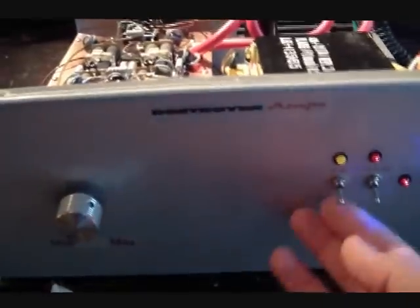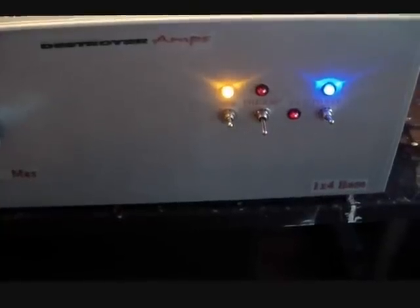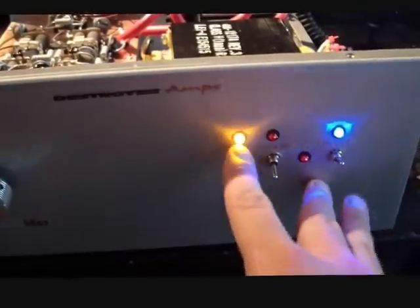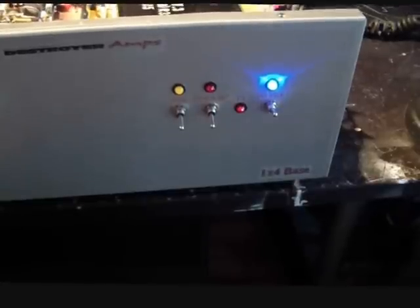We also have single sideband. What this is, basically, it just adds an extra delay on the relay so you won't get that extra chatter, that choppy sounding noise as you key up. The preamp option — one thing I forgot to mention — is not on our website at the moment. I've been busy tackling other projects. Just drop me an email when you place your order and we'll go ahead and throw that in there for you.